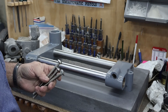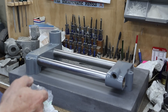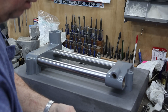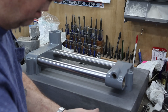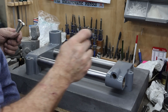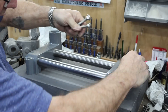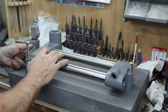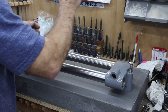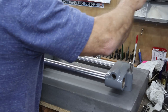I did go and get stainless steel hardware for it and I've already ground the back where it needs clearance for the rear bolt hole to anchor it down. I got all stainless hardware to mount it. I think those washers are going to be small enough diameter that they'll fit, otherwise I'll have to make some changes. I've relieved the corners for the squares so they will set down the way they're supposed to.